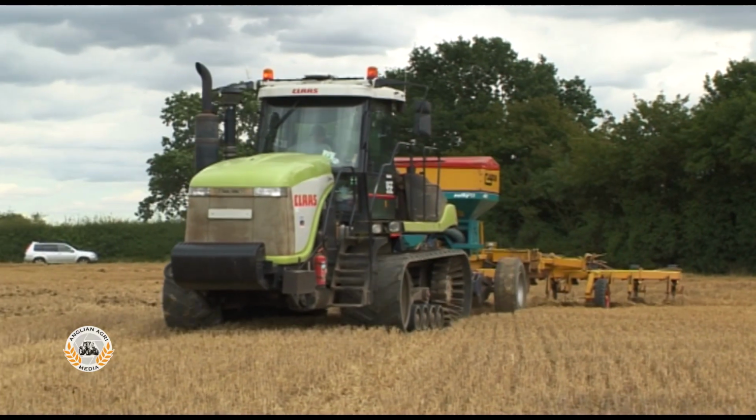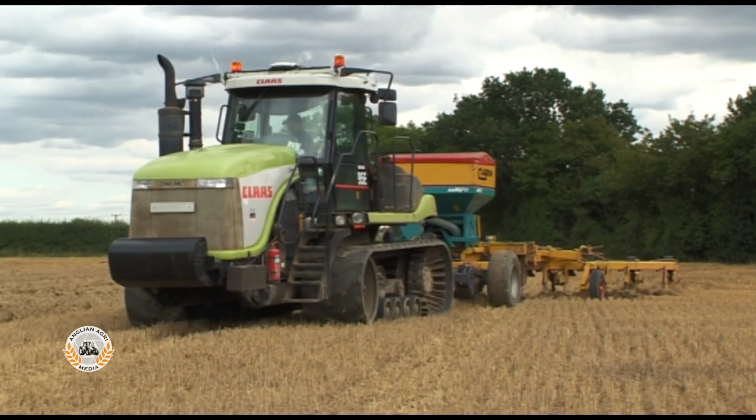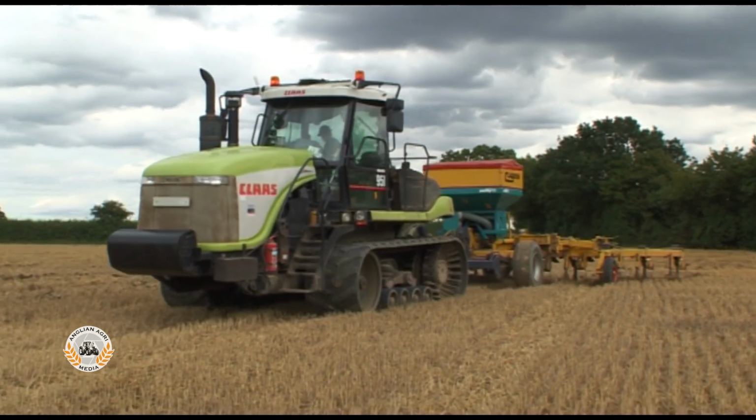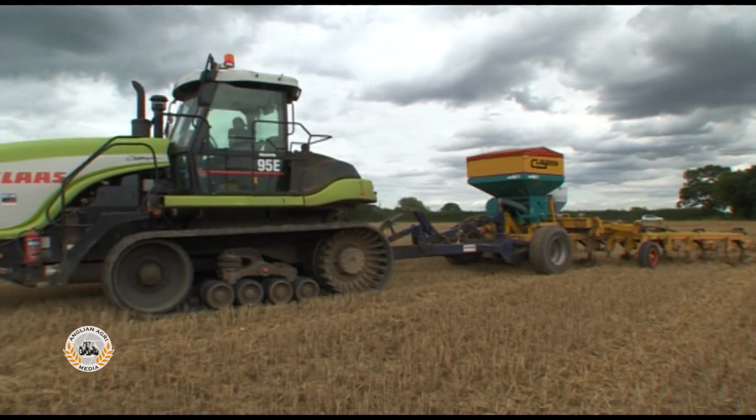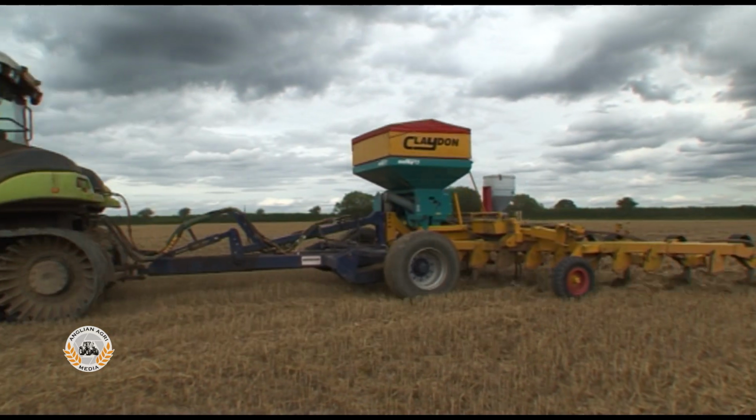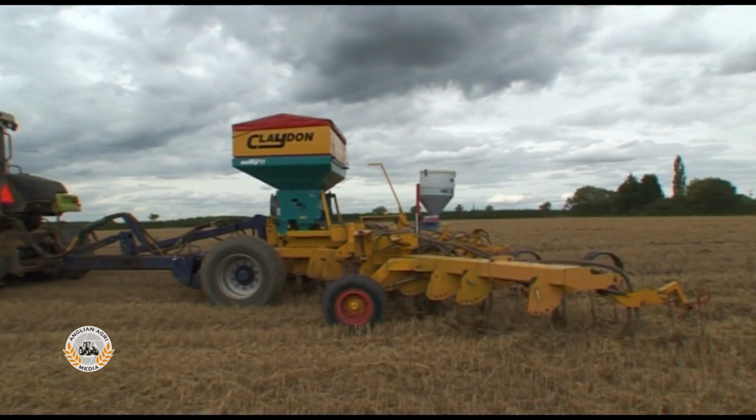Like their predecessors, the E-Series tractors used a 10 forward, 2 reverse full power shift transmission with plenty of close-spaced ratios in the working range. The top speed in 10th for transport work was 25 kilometers per hour.